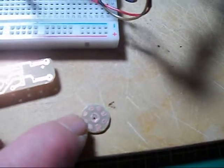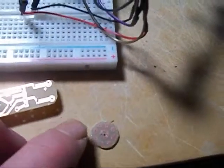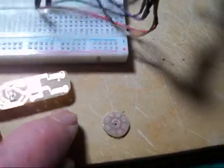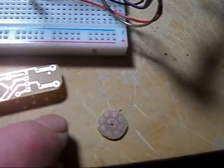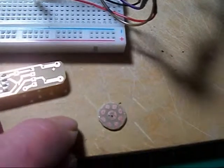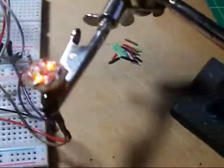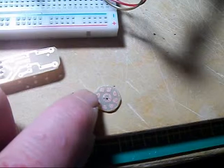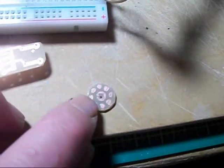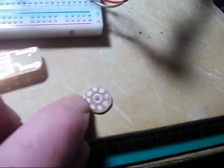What I discovered — and what I should have done from the beginning, it's common sense — is before I even put my LEDs on, I should tin them first. Put a little solder on each connection. When you do that it works a whole lot better. Then put just a little solder on the board on the ground side and the pad, and then using some tweezers just set that LED on there and melt it in on each side.